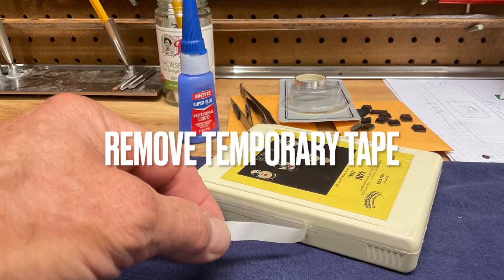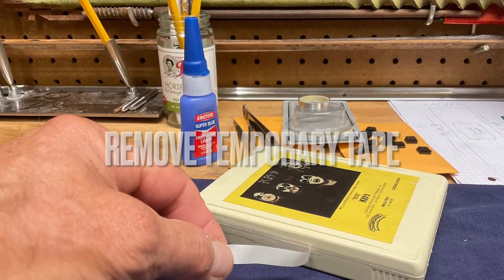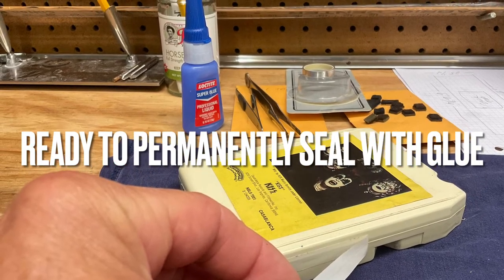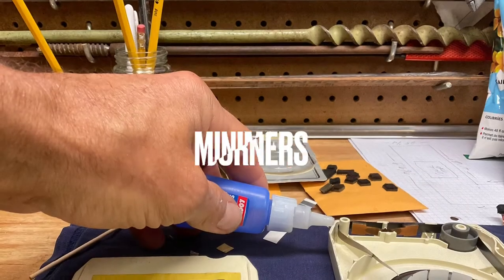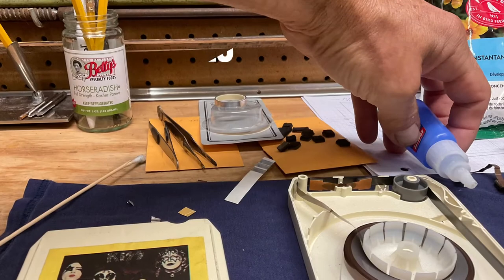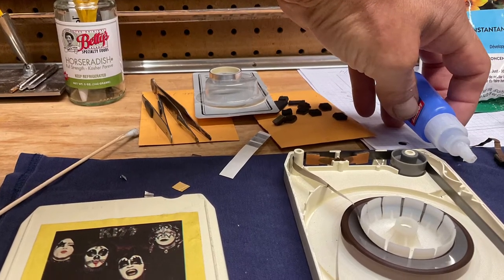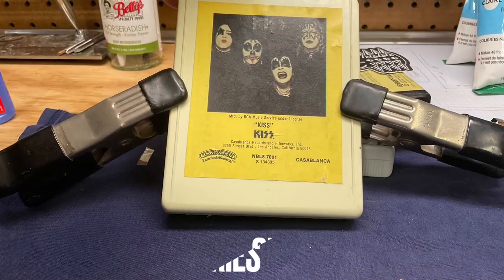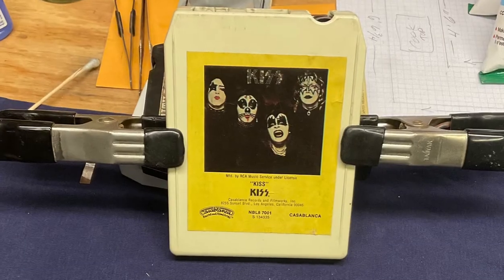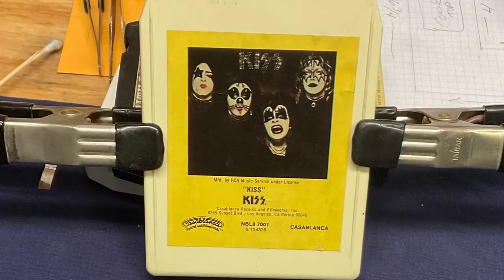After the test run — it sounded pretty good — what I do is remove all the tape that temporarily holds the two sides together, top and bottom. Then I start gluing. I use a very minimal amount of glue, just on a couple of points around the top edge, the sides, and the bottom — the further away from the tape, the better, since you don't want to get glue on it. Then I put a few clamps on for a couple of hours just to get good pressure for it to dry.